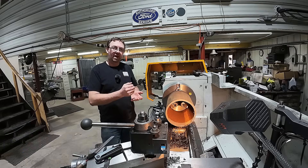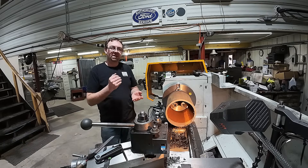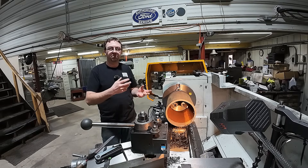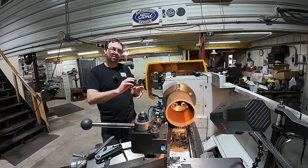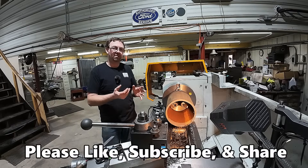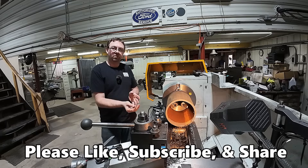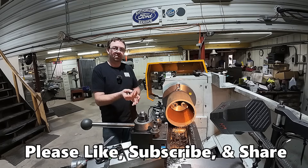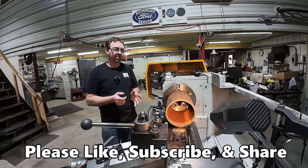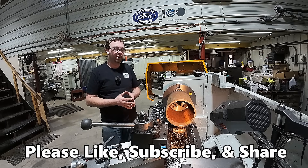External tools are at center or below. Internal tools — boring bars and such — are slightly above center. And if you run an insert tool, their pitch is turned to change that center location so they're cutting better. So just raising that tool up just a little bit to do that inside chamfer will change the geometry, change everything, and make it so much easier for you in the long run.